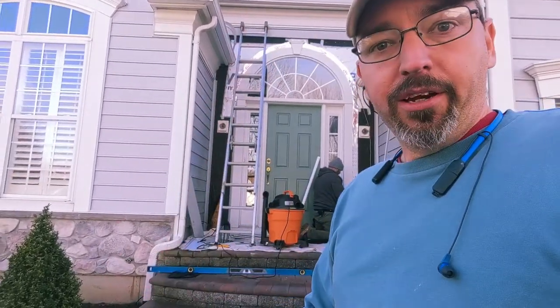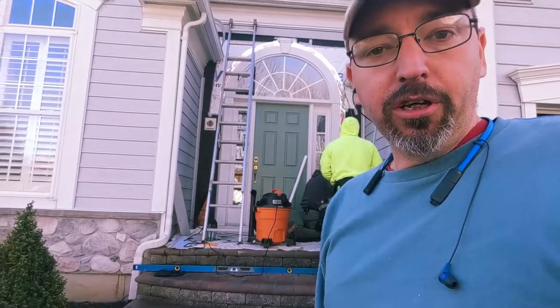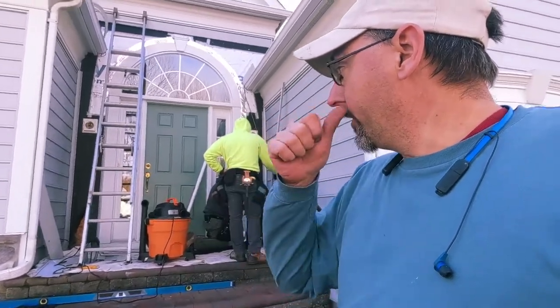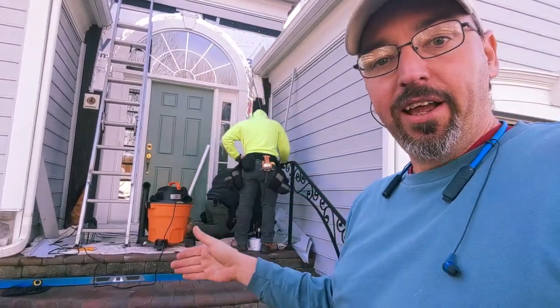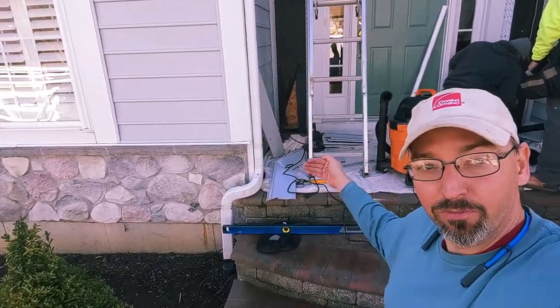But let's say you just throw your deck in front of it. When that moisture gets to the bottom of that rain channel that's now behind your brand new cement steps that your landscaper put in while raking leaves or putting your gardens in — where is that water going to go? Is it trapped behind the stairs? With vinyl siding, any water that gets behind those pieces comes down the face of the house wrap, and when it gets down behind there and it's two inches below the top of your new patio — where's it going to go? It's a bad situation.